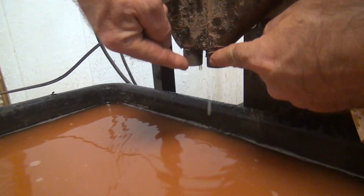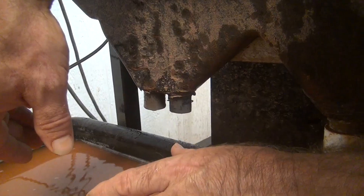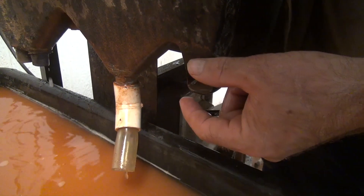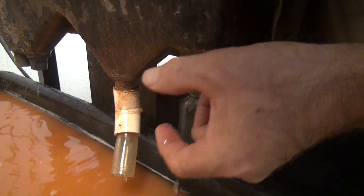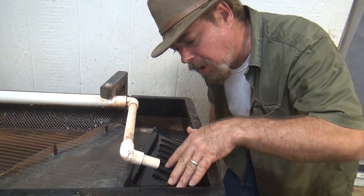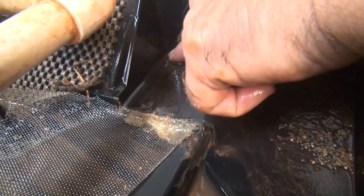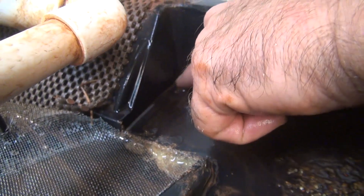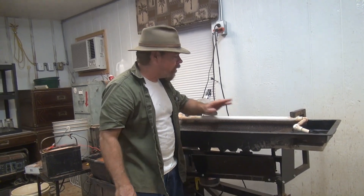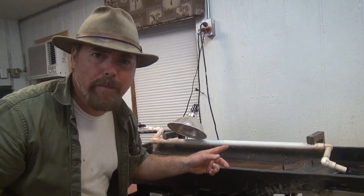You're going to need two very flexible lines coming off the ports into a container — I like to keep my container in the water. Ports two and three in my book are trash and feed into a large five-gallon bucket. A lot of guys build a line that comes out from there because it creates a large mess after a while. Where you feed in you can see all the riffles — their job is to help break up material, but I've actually seen pieces of gold get trapped in the corner over here, so don't forget to look there. It acts as a natural trap. Don't put the table outside because the sun will warp the plastic, and once it does the table is trash. Make sure you check the tension on the pulleys and grease the bearings because they'll get dry from time to time.